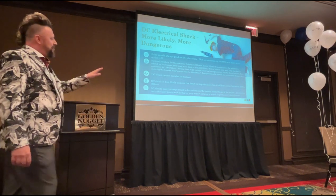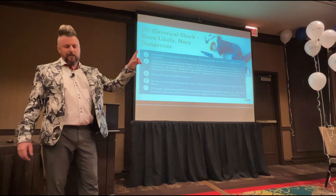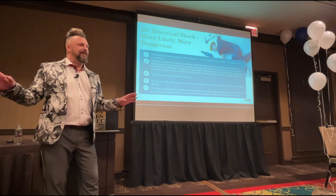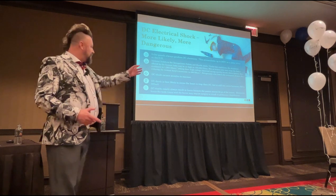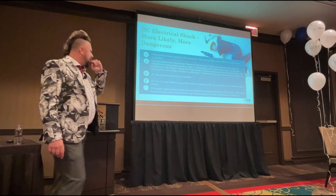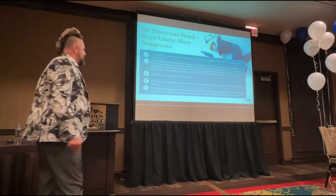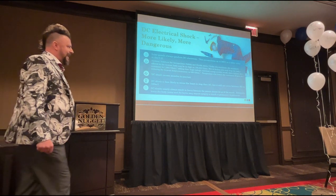So DC shock is less likely to cause the heart to stop than AC. This is a common misconception. People think that a DC shock is safer than an AC shock. You don't want any, trust me, but people think, oh, DC is not so bad. DC just affects the body in a different way. Just because it doesn't make your heart stop doesn't mean it's not doing you damage. It's still cooking you, you know? However, you can have your heart stop by DC if the shock occurs between 300 to 500 milliamps. DC shocks nearly always result in burns because the person cannot let go of the source.